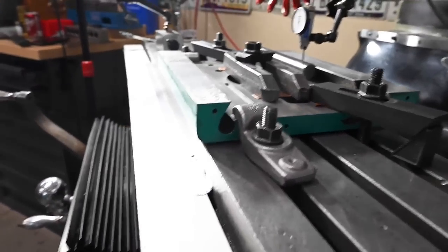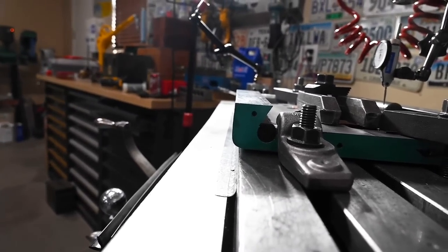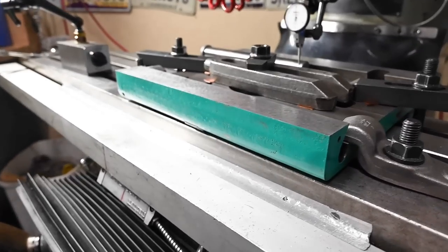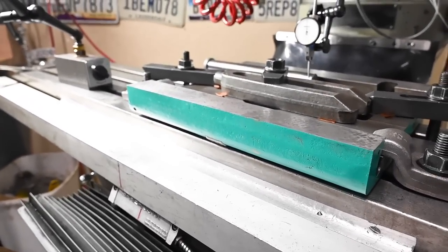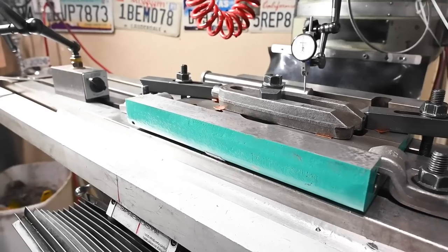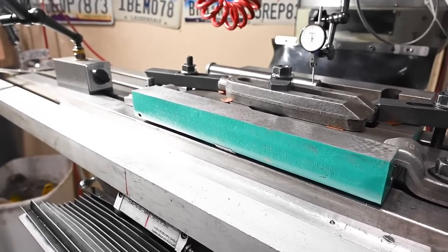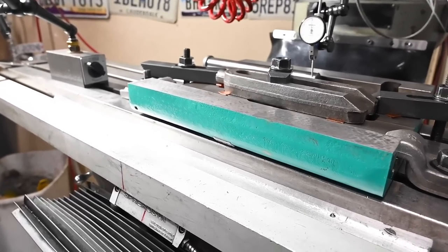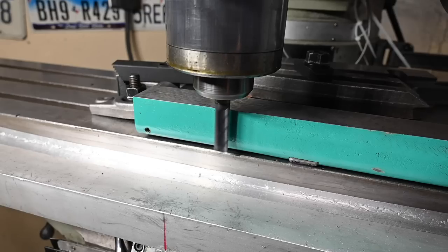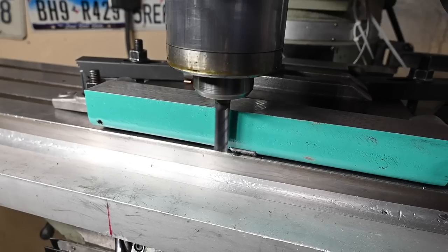The idea is to be able to hang the end mill over the table and not cut the table, which is important. And again, we're just gonna go for majority cleanup. If there's still hollows, or even if there's still some paint left, that's totally okay. We're just going for an almost all the way cleaned up. And then we can mount our mounting bar to this. Got a half inch 4-flute carbide end mill, and I'm not sure exactly where the highest spot is. Maybe it's more towards the middle here, to give us a touch off spot.